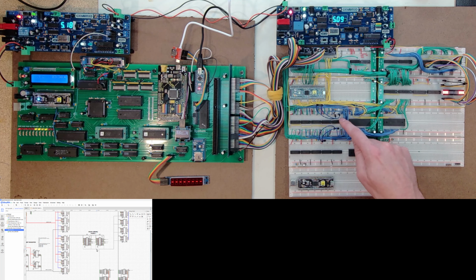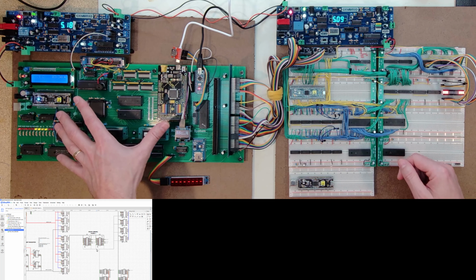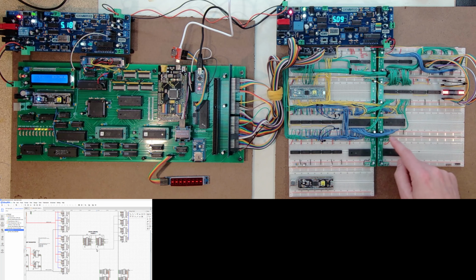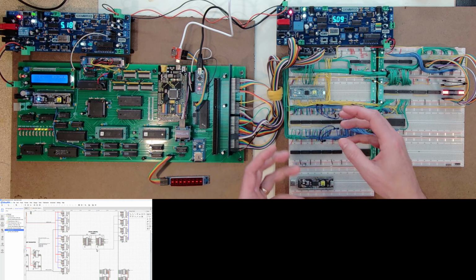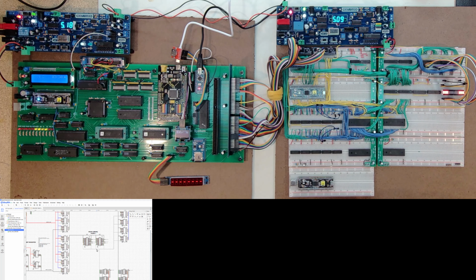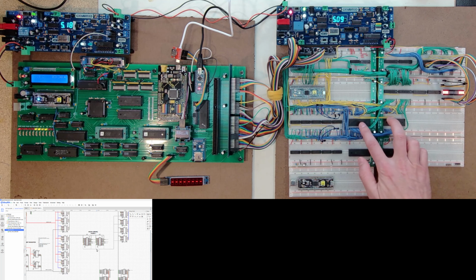And the other thing I need to do is I now need to change the upper 4 bits used in the addressing to not be grounded, but to actually pull from my register. So I've got those appropriate bits up here, and I'll just pull off of that. So as I do an IO out to that register, I can dictate which 64K segment I am working with in the memory. And right now I have those 16 segments. I have this all at 0, which means it's only using the first 64K segment. But as I increment this and flip one of these on, basically I got 4 bits here. So as I go from a 0 and work my way up to 15, I can navigate through all 1 megabyte of this memory right here. And that same thing, of course, will happen when I get down here to this.